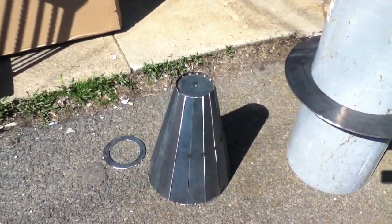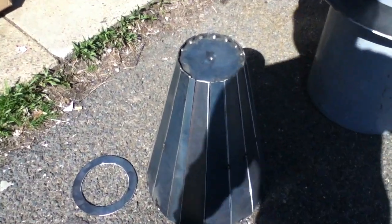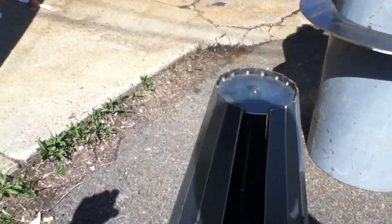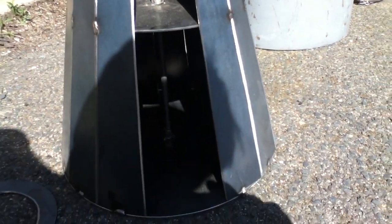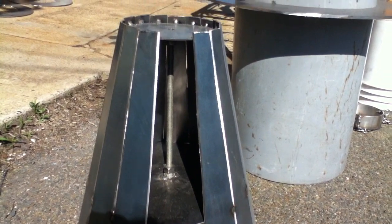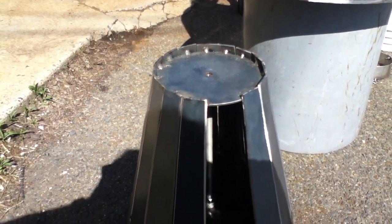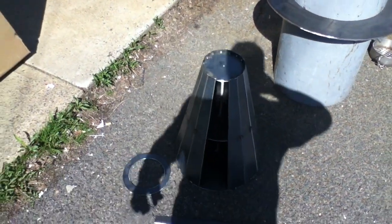The funnel consists of 16 pieces all the way around. I kind of have a jig set up here — two of these pieces are not tacked in place, these are the last two. Inside there's a piece of all-thread and a nut tacked to the center of three circles so I can adjust them to where they need to be and lock them down with a jam nut. You know, for all those people that said you'd never need math in school — I was one of them.